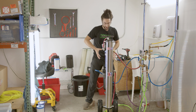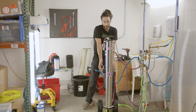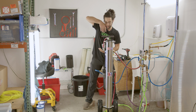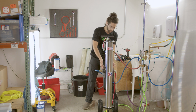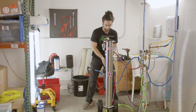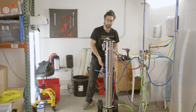If there's more room in that cartridge, then less of the water is going to get absorbed into the resin chamber. You also risk channeling by having too much water being able to pass through a section of that filter, causing the rest of the resin to kind of harden. There, you're not going to see a good TDS result. So all in all, it'd be time to start with a fresh bag of resin, change out the chamber, fill it tight, and reseat it. If you receive 0 TDS afterwards, you know that the issue was just resin. It's time for a resin change.